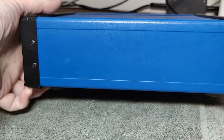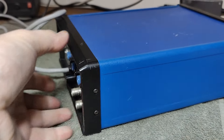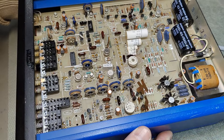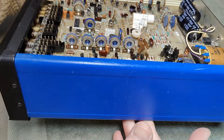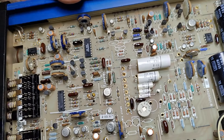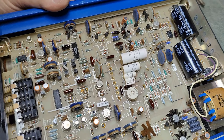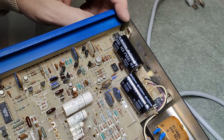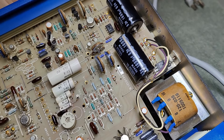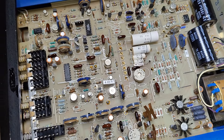I think this is the way to get in — I don't see a lot of other ways, so it must be those screws. There's a loose top and a loose bottom. That was super easy to get in. Look at that beautiful design — everything here is just perfectly well organized. It's op-amp based, of course, because this one is from 1981. We've got negative 12 and positive 12 — just classic 7812 and 7912 regulators. Capacitors pass my visual inspection.